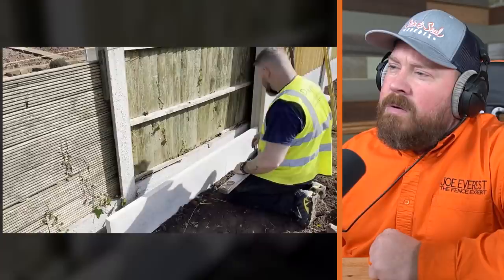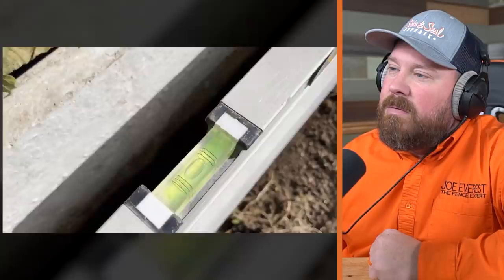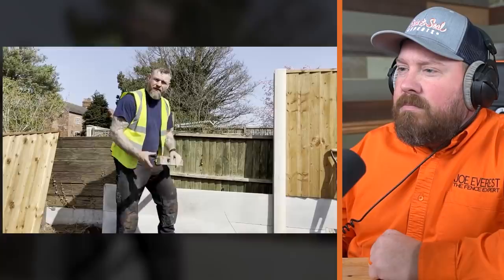This gravel board should go straight in. Let's get these gravel boards in and see if it worked out right. Gravel board's in — straight in. You can see the mark we put in. You don't need to lift that in and out. Me and Steve are going to put the next one on top, then show you how to put the panel on and where it needs to finish on the post. Second gravel board on — you don't have to use two gravel boards; same principle with one, two, or three. Check with the level — absolutely perfect. Panel time.